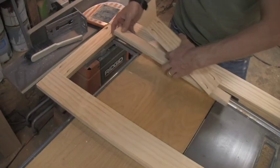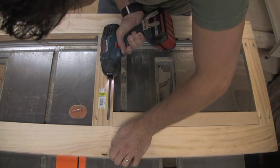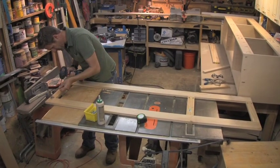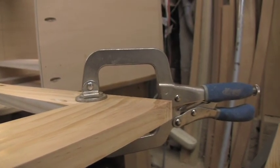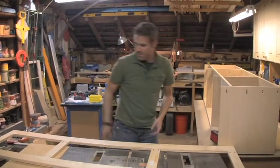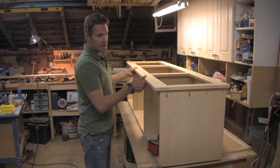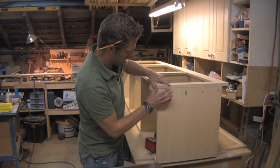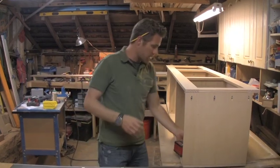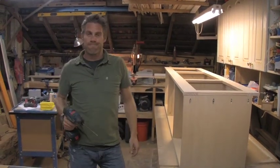The spacer really saves time, not only when installing stiles but later when building drawers — it keeps your face frame square so you can build all drawers the same exact size at once. Don't forget to use the face frame clamps; they hold the joint flush while you run in the pocket screws. There is the face frame — voilà! It goes on just like that, flush over here. Because of how we set it up it'll be flush to the bottom, and we just run screws into all the pocket holes we pre-drilled — simple as that, about 25 more times.